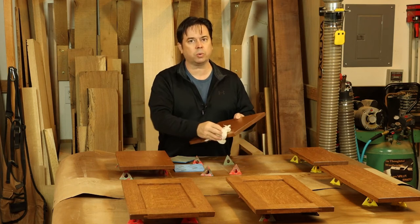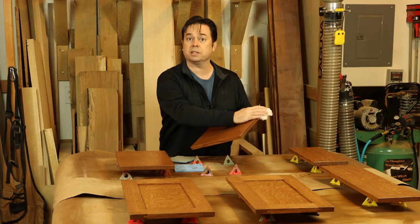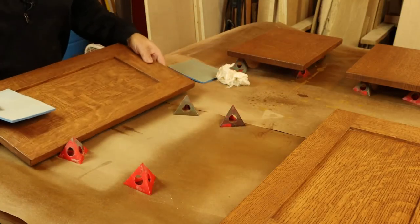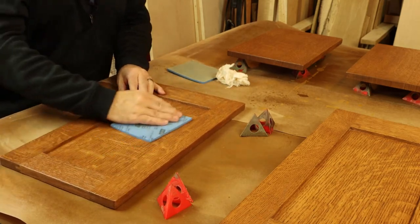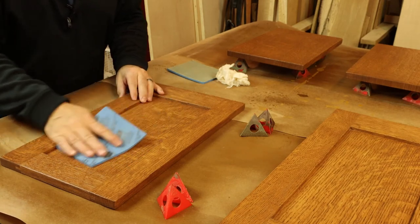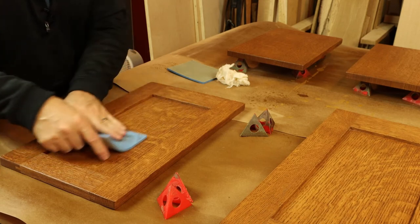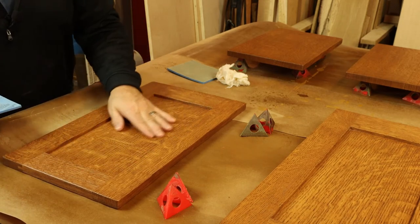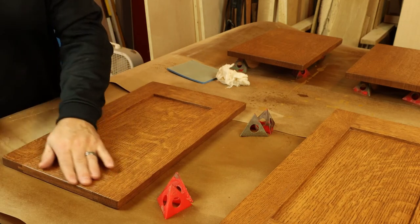It's just the basic hardware store variety, but it does a great job at quickly removing that dust, getting you ready for the second coat. You'll have the best results if you pull your workpiece down off of the painter's pyramid while you're sanding, just to avoid little dimples or dents on the backside. And honestly, it just takes touching that surface with this super fine grit sandpaper, and you'll get that nice smooth finish here after. Second layer just adds to the coating thickness.